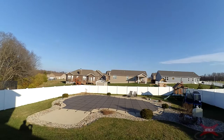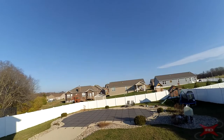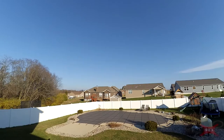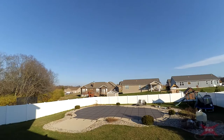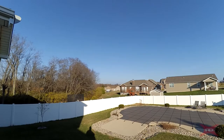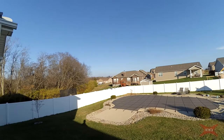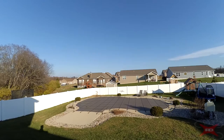You cannot do 3D flips with the obstacle avoidance module or camera attached, but both are detachable. Removing the obstacle avoidance module will give you a little more flight time since you're not powering it. I would not advise flying without the camera since an open hole at the front could affect aerodynamics and the barometer. You can swap in an SD card camera for better quality video, and they also sell a 5.8 GHz camera for use with FPV goggles that gives much better range and nearly zero lag compared to Wi-Fi.